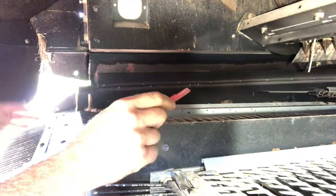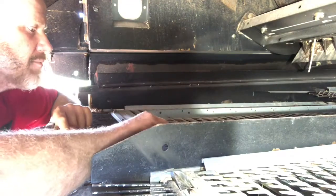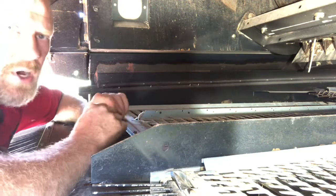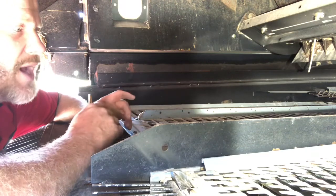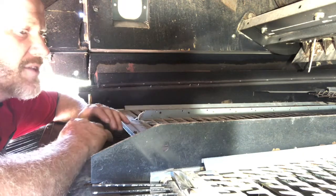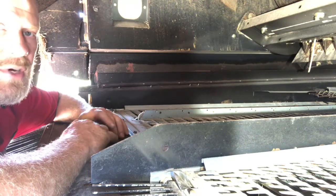Until I can just slide that 6mm step in. Now on your flagship machines you've got a right and a left sieve, so we want to check both sides and make sure we're at that 6mm. Particularly on an older machine, just spot check it around 2 or 3 places and make sure your average opening is pretty close to that 6mm. You can get some flexing in those slats over time with older machines, but if you're pretty close overall, that's going to give you a machine that runs good in the field.